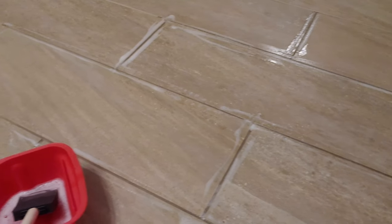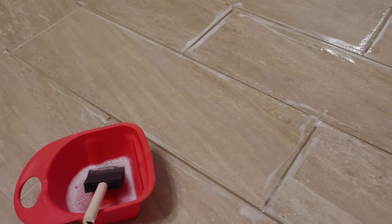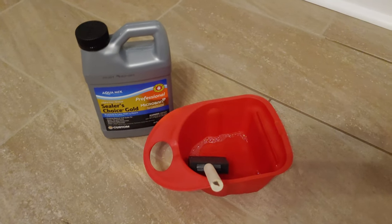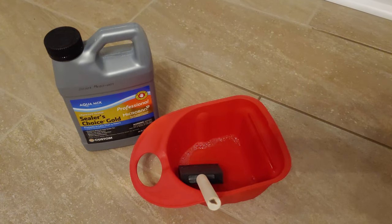So this will be something either you have to ask for or do on your own, but it's not a difficult job. You can do a 10 by 10 or 15 by 15 room in probably about an hour for each coat. That's a quick and easy job — just a little bit of an investment — but that's how you seal the grout on your tile and protect your investment. When it's all done, it'll dry clear just like that and look wonderful. Hopefully this helped. This is the Eclectic Candyman — until next time, we'll see you later.